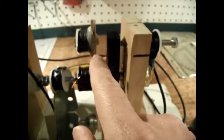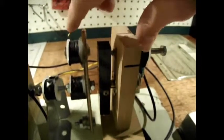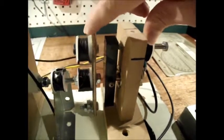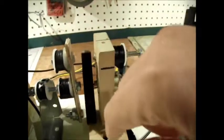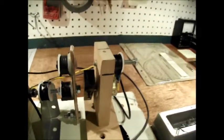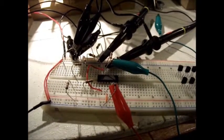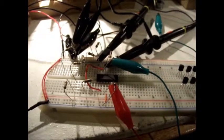There's a pretty good gap here. If I squeeze these together, I'll show you that on the oscilloscope you get an increase in the size of the signal off of this rotor. This one is plenty large — it's close enough to the magnet, so I'm not having a problem. It's just one coil; it doesn't jump through coil to coil to coil to get the output signal off. On my breadboard, I'm using an op amp to amplify the signal — really it's just being used as a comparator. It just sharpens the edge and gives me a square wave out.